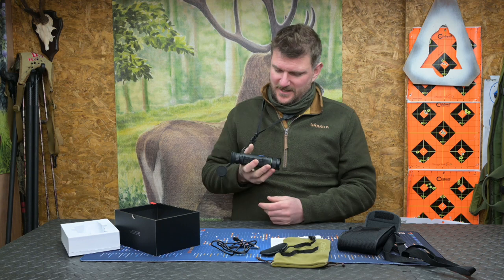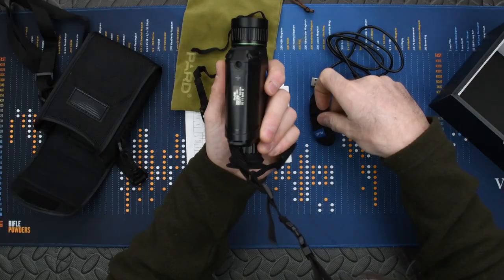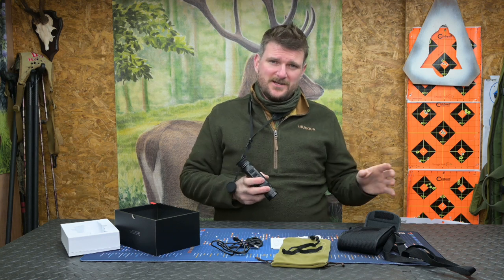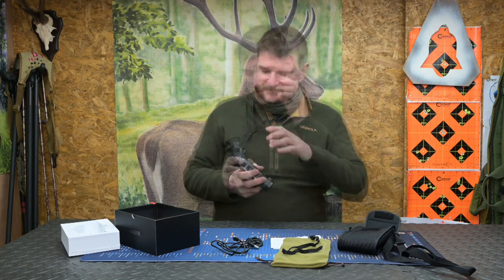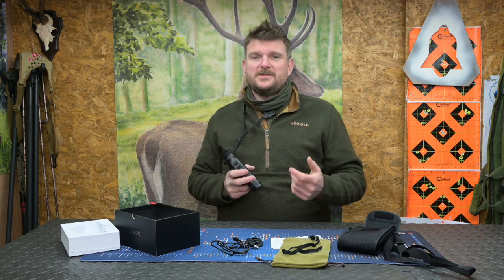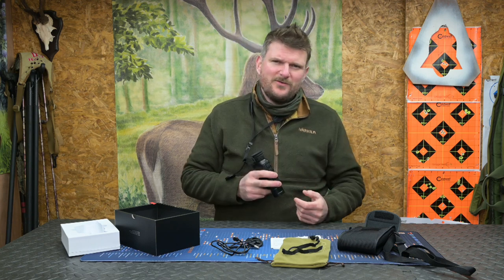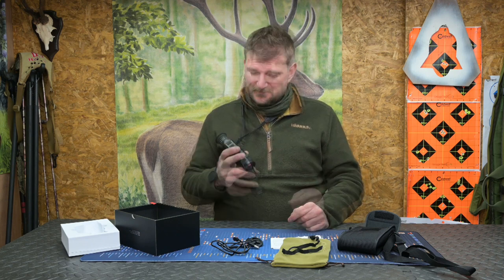There are slots for attaching accessories, and a quarter-inch UNC tripod mount on the bottom if you want to put it on a tripod — handy if you want to run a secondary display via Wi-Fi. But don't forget you get more latency that way. This has a 30 frame per second refresh rate so you get smooth tracking, but latency from communicating with a smart device means you're just not quite in real time, and in fast situations you don't have milliseconds to spare.